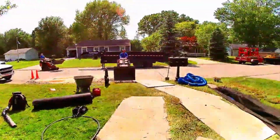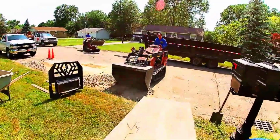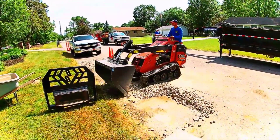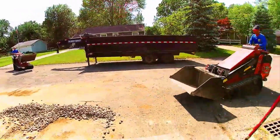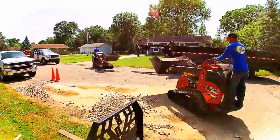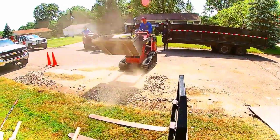And these runs on a farm, you're doing just hundreds of acres, miles and miles of runs. So they're collecting the water over a greater distance, filling the pipe over a greater distance. Yard drains are different. We need to collect all the water right now, right here, right now, and fill that pipe as fast as we can. That's why we want more inlet. That's why the high octane is such a value to a good yard drain pipe.